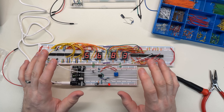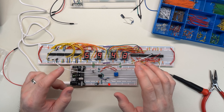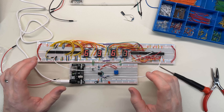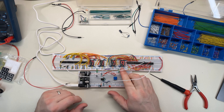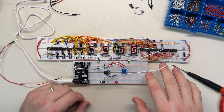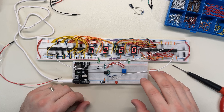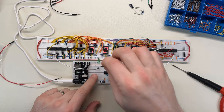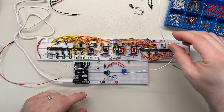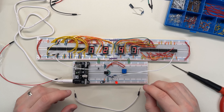Okay, we're having some technical problems. I'm not entirely certain what footage I may have lost because the computer seemed to freeze and I lost my video preview. To recap: this side is not counting correctly — it's skipping digits and I don't know why. I'm not sure how to debug this. Either something's loose, something is connected improperly, or there's a subtlety in the signaling. Let's disconnect the carry and it's still doing it, so even without that connected to anything it's still wrong.